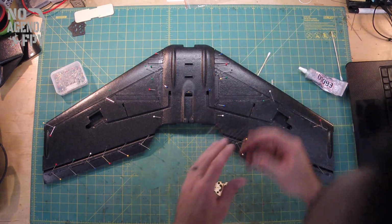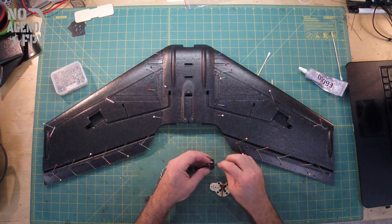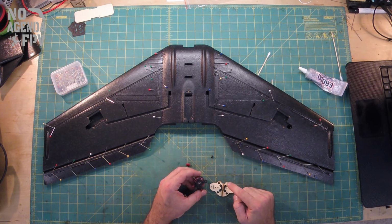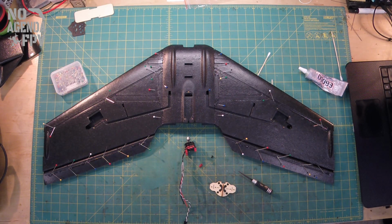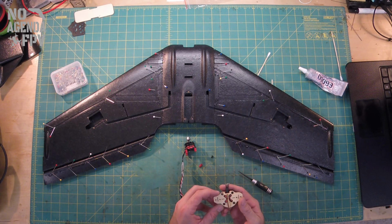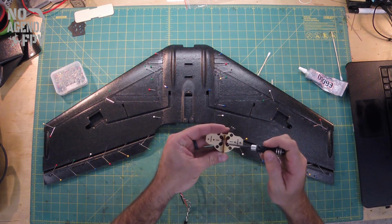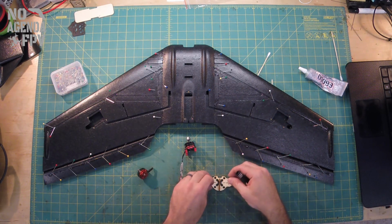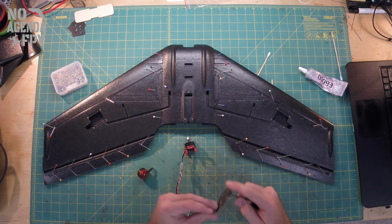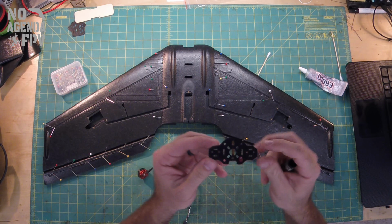Like I said though, before I go and do something dumb, I'm going to take my motor mount, and normally at this point you'd want to actually screw your motor on there and put the screws through the 4 inner holes. Here, here, here, and here, right to your motor, but because we're using the standoff, we're going to use the outer holes. So I'm going to take the screw, put it through there, and I'll put this standoff on there. So we'll put all 4 of those.